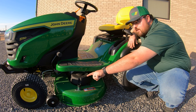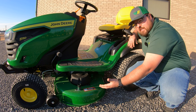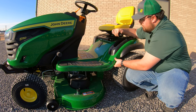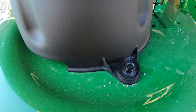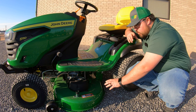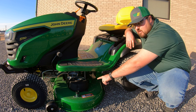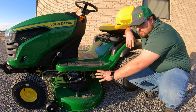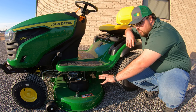There's a whole system on the back side where you can change the wheel height — lower them if we're cutting higher or raise them up if we're cutting lower. We're also going to have two covers on this deck over our spindles, removed by a bolt. Make sure to remove those and clean out from underneath the spindles when done, but you must have those covers on when running this mower — they act as covers and also as belt guides helping to hold that belt into the spindle pulley.